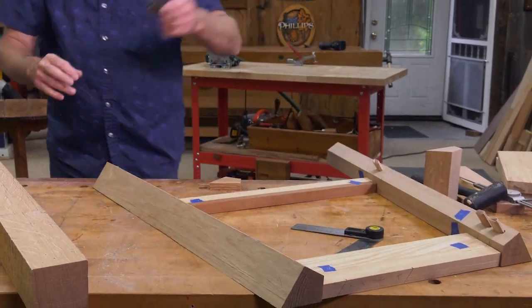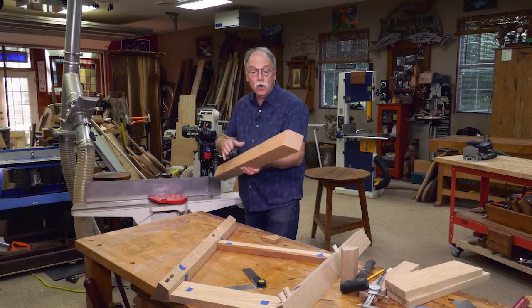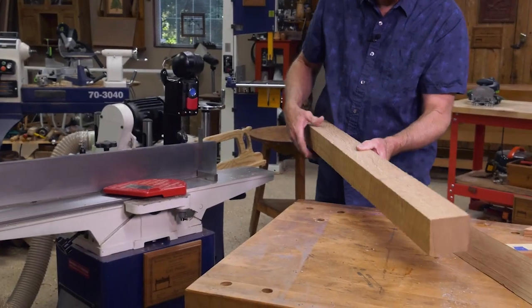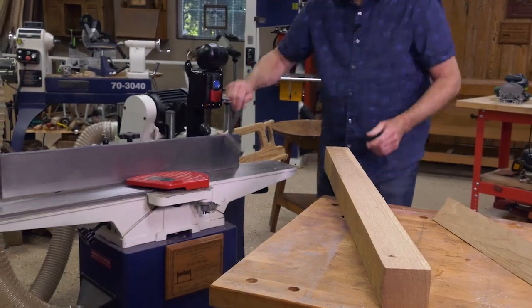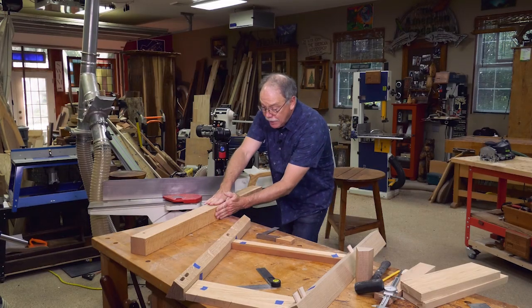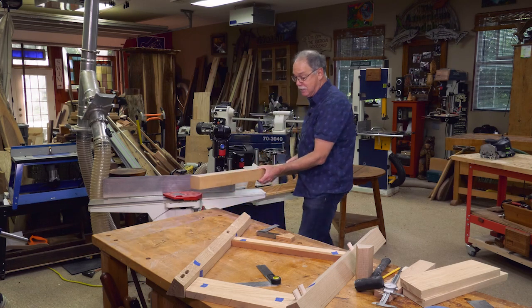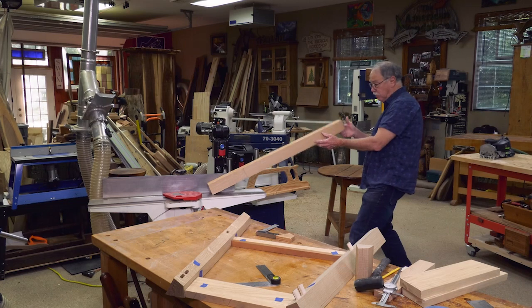And it all starts by first making two edges of a white oak three leg work pieces square to each other. That's what a jointer does. So I'm going to use the jointer now to square up two edges, 2 3/4 by 2 1/2. That's key.